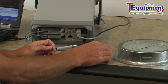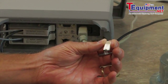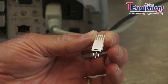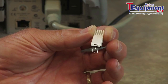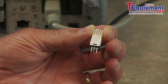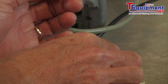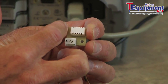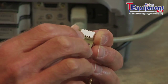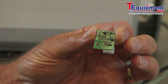Here are several examples of the electronic hygrometer. These are three-pin devices that work very well in the types of conditions you'd have in a home or office environment. You apply five volts to the first two pins, and then the third pin gives you a voltage that is based on the relative humidity. This one in particular lets you see the resistive device that changes resistance based on humidity, and on the back you can see the circuit used to create the proportional voltage.